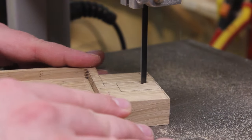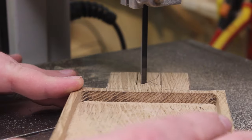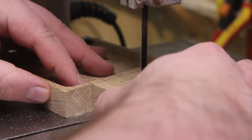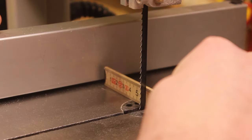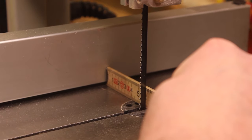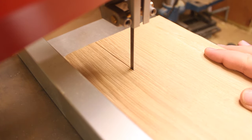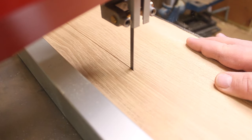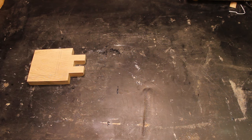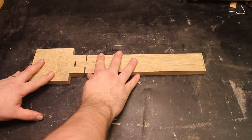The next thing I needed to do was cut out this notch. Essentially what it forms is one big finger joint, which is the attachment between this and the upright section of the lamp. Then using a ruler just to set my fence on my bandsaw to cut out another piece of oak for that upright — I actually find using the ruler much more accurate than using the on-bandsaw guide. You can now see the pieces: the top of the lamp and the upright, and you can see how that finger joint fits together. It's not particularly complex.